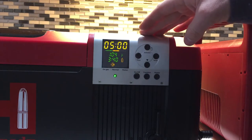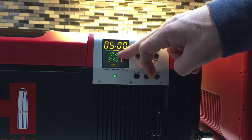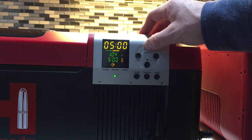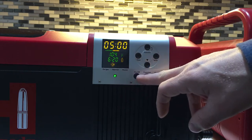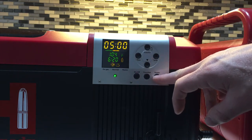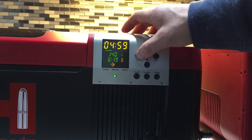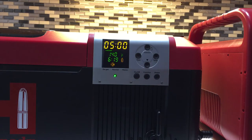This is the digital control panel on the large unit, located on the face of the unit on the right-hand side. You have your time, three bars that indicate the heat level, and your temperature. There's also a solution timer — you can set that so you know how long the solution has been running. You have degas and normal modes, a function button to switch between them, a heater button with flame indicators to show the heater is on, and an on/off button. Your temperature gauge goes up and down, and your timer goes up to 30 minutes.